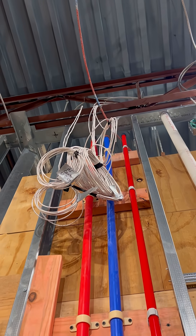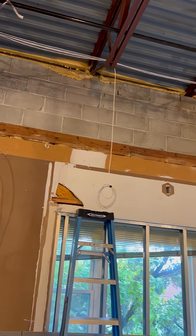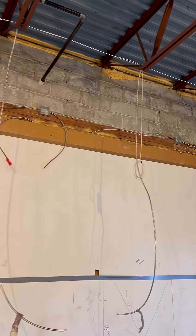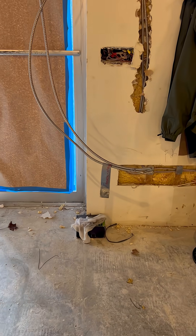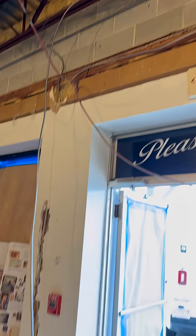Towards the left side there, you saw that piece of cardboard — we like to use cardboard basically to just poke a hole in it and then poke the wire out into the strategic location that it needs to be in. Over here we've got five sets of low voltage wires. Each workstation requires one low voltage wire for more LED strip tape. Over here is basically going to be the waiting area, and they wanted more LED strip tape over there, so we've got to start running wires for that as well.